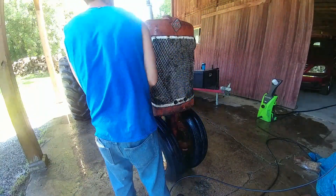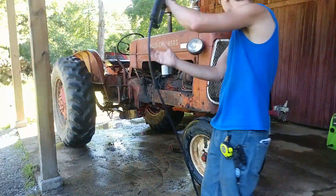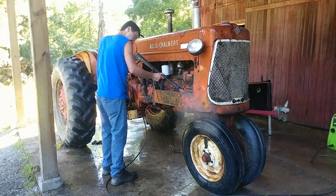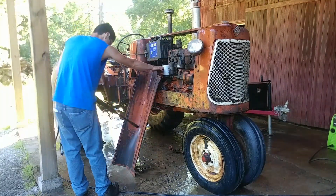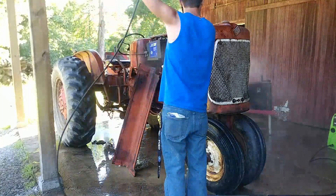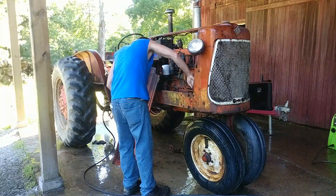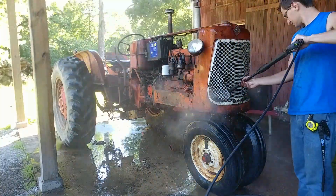This radiator has three sets of cooling fins — so like three passageways for coolant. After I blew everything out onto the motor side, the whole front of the motor was just covered in little white tufts — it almost looks like cotton. Like a cotton flower or something that grows around here in western Pennsylvania. Whenever you're mowing and it hits the radiator, it gets pulled in through the fan.